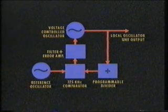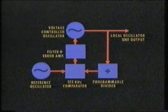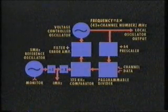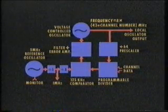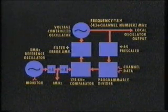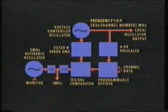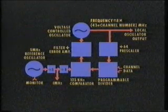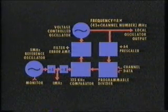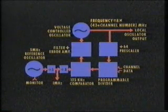This shows the UHF voltage-controlled oscillator, whose frequency is determined by comparing a divided-down sample of the output with the reference oscillator. The reference oscillator is a 5 MHz crystal in an oven. The reference oscillator should be as high in frequency as possible, subject to the limitation of the maximum operating frequency of the dividers. This unit uses an ECL pre-scaler to allow the use of programmable dividers with a maximum operating frequency of 15 MHz, which in 1981 represented the limit at reasonable cost. This then determines that the phase comparator works at 125 kHz.